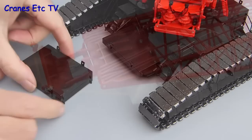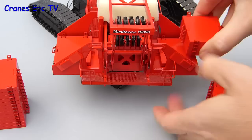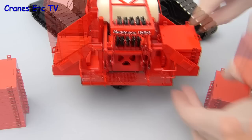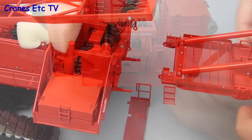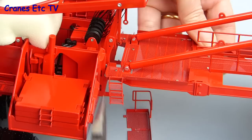With preparations done, the first assembly step is to load up some ballast plates between the crawler tracks, followed by the plates at the back. These are nicely made metal parts with lifting lugs and rungs that form a ladder as each ballast plate is added. To increase lifting capacity further, extra counterweight is added on a special carriage at the back called the Maxer. It attaches with a pinned connection which is a bit awkward, requiring pliers — and this is where the detached walkway platform helps, making it slightly easier to do the pins before attaching the platform afterwards.